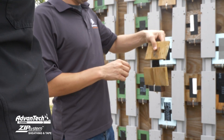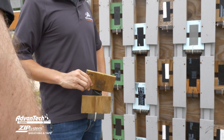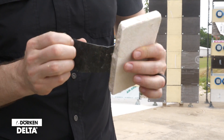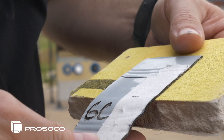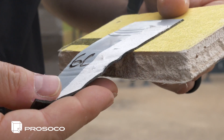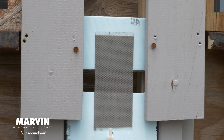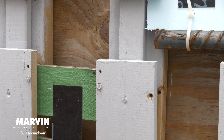So we're performing tests on a variety of tapes out here. We're performing exposure testing as seen on the right, and shear testing. The shear testing in particular is what we're working on today — we're testing a piece of tape across a substrate with a one-pound net weight below.